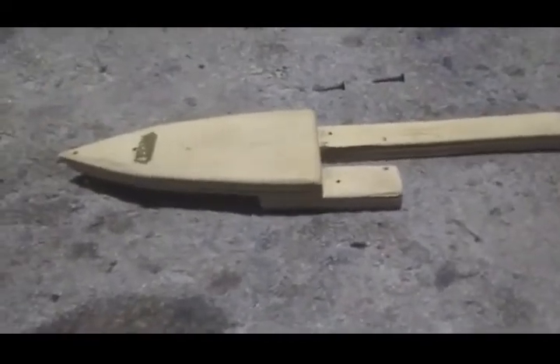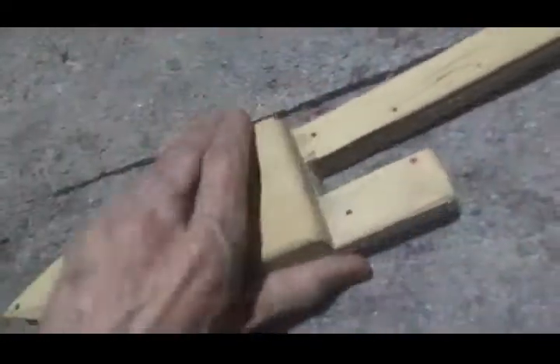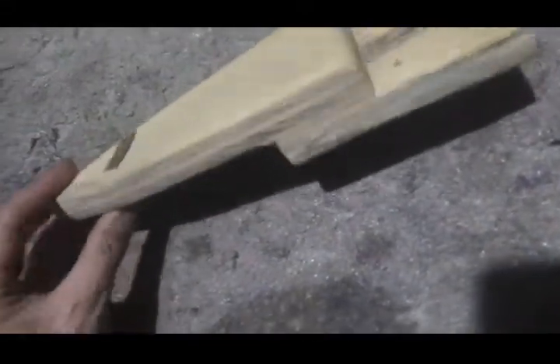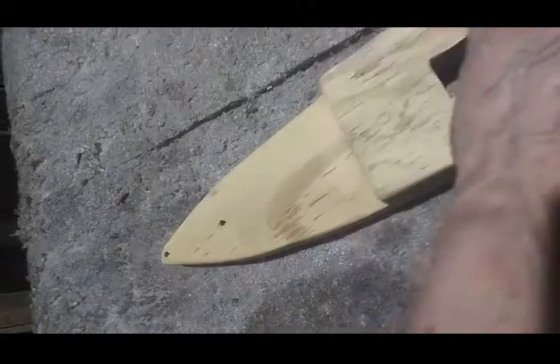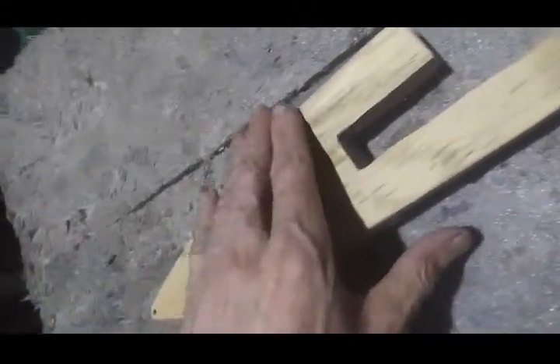At this point the body would be ready to be finished as far as the sanding goes — everything feels just fine. That was just basic sanding with 60 grit. I hit all six surfaces, this direction and that direction, and rounded all the edges everywhere except for inside here. There's enough bevel here — it's comfortable. The fact that it's not sloped is not a big deal because it's still round and smooth, all soft and fine. You could come in with the grinder and grind these edges down and cut a bevel on this.